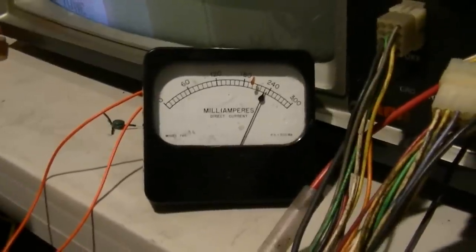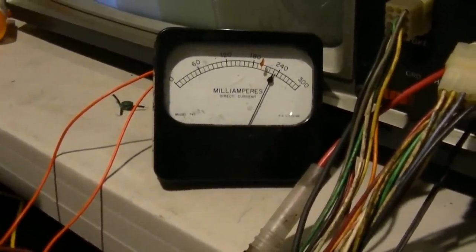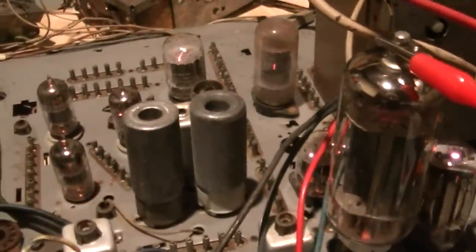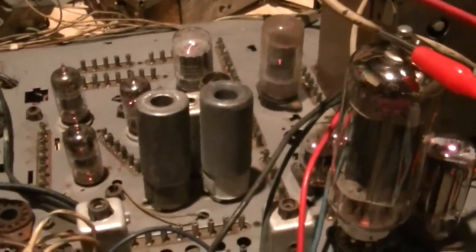This set doesn't like the jig yoke. It's okay for testing but we should really be down around that lower mark. I don't like running high plate current - it makes everything hot. The color is getting better as it runs - adjusting the horizontal hold, getting the color to lock in. It's interesting - maybe it's a phase detector diode issue. I sure seem to have a lot of those lately. But it's getting better.